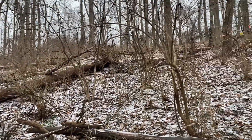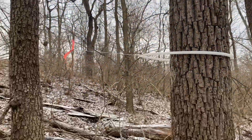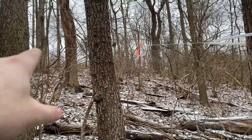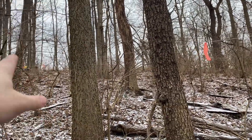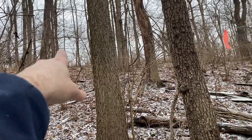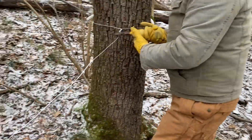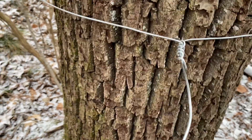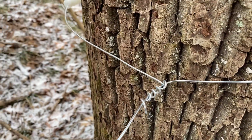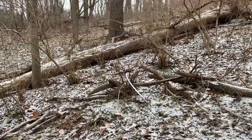We did our next run down the hill and we are down here at this big cherry tree. This is where we are trying to work all of our other lines to — this was the home run for those first two lines. They tie together about 40 feet up the hill and there will be one home run coming down here where we will have our big collection tote. We just put a couple of pigtails around right here and that gives us plenty of grip.